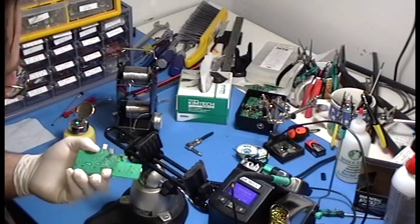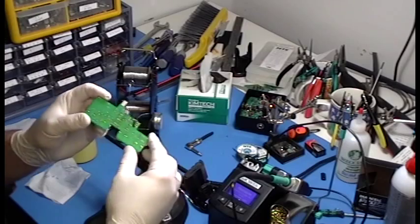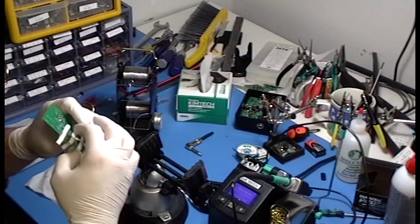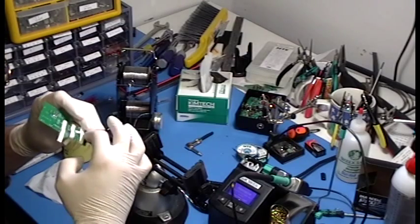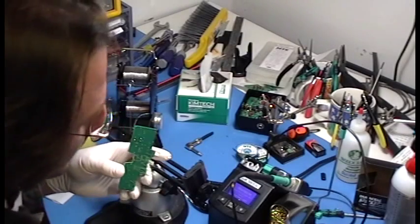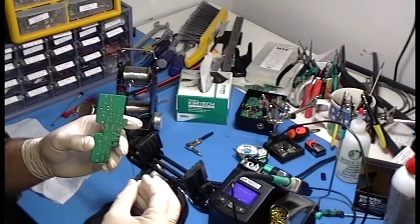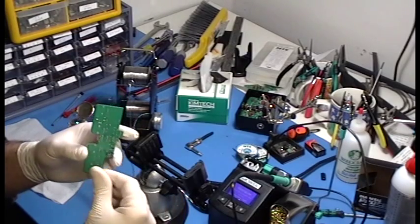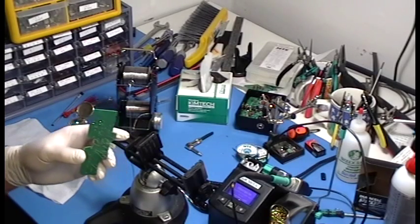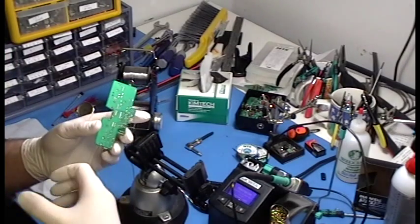Again, we're going to take the time to do it right. We're going to cut all of these before we ever apply solder. There's a case or two where I don't do that when we're wiring up the chassis. It's not such a big deal on larger joints, and it's not such a big deal with wire because the wire has some flexibility to it, so you don't really get that horrible shock. But with these, you really do get quite a shock when you cut them.